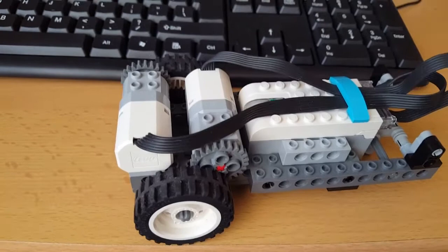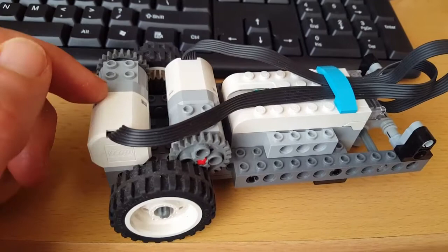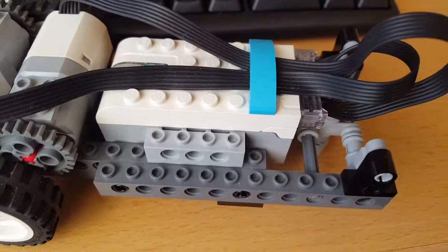As you can see, it's a fairly simple arrangement. It's got a skid-steer arrangement, two wheels — or two motors, I'm sorry — one for left, one for right. Each one was connected by a gear, and below that there's basically a bevel gear, which is connected to the drive shaft for each wheel, and this drives each wheel independently and allows you to steer it.